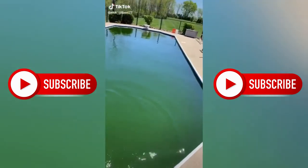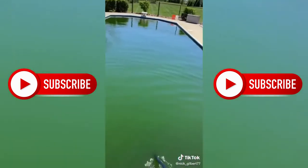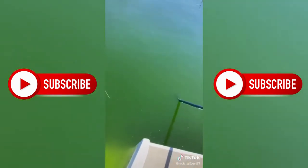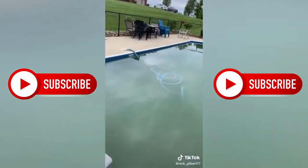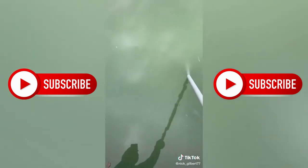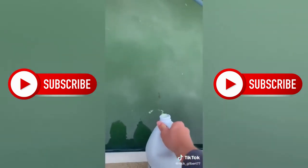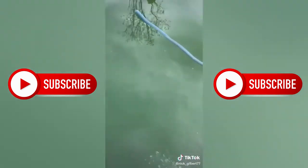Today I'm gonna show you guys how we clean our pool here. First, we start off by taking a brush and brushing all of the dirt down to the deep end. As you can see, it's absolutely disgusting with all the algae and everything. We'll get it cleaned up. Then we begin to thoroughly vacuum the pool to get all that nastiness out. It's starting to clear up a tiny bit. Next step, you want to put about four gallons of pool shock in the pool and let it sit overnight.